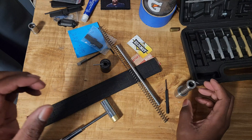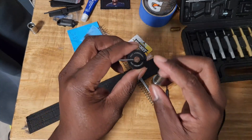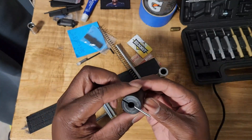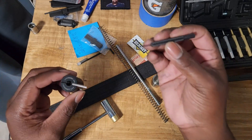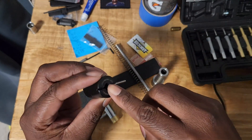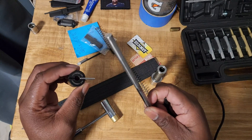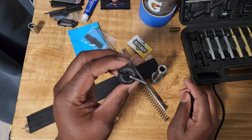I want to go over just how this process actually works because I had to figure this out on my own. To begin with, everything is captured by this roll pin in here. When you want to change out your buffer weights, you just take anything that can push that roll pin out of the way — far enough that it can clear this plunger in the middle.